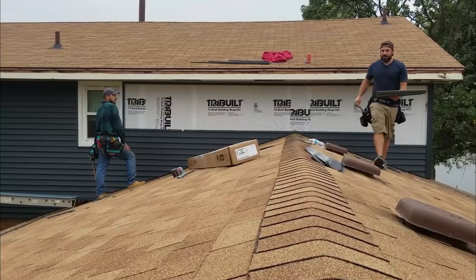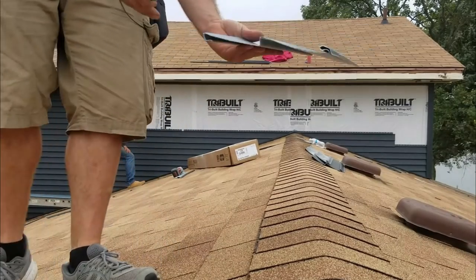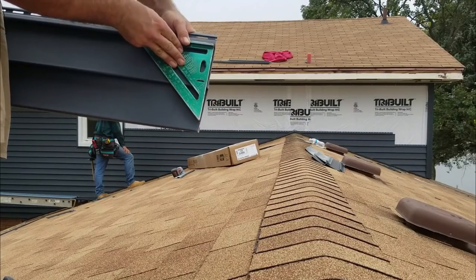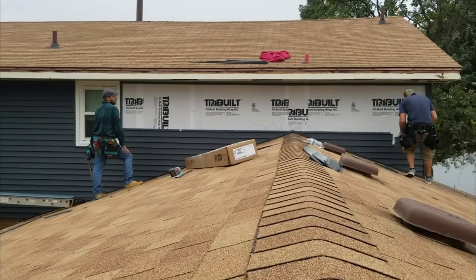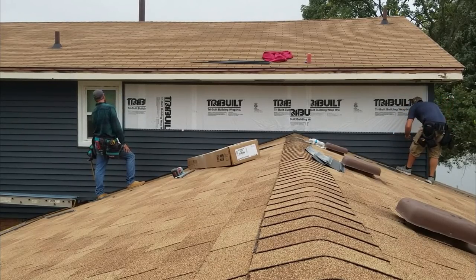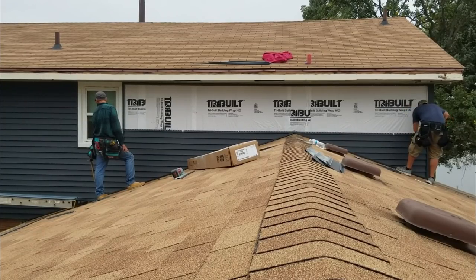For anybody who wants to say anything about me not using a square, let me just show you this real quick. It all gets hidden in the J, or the corner post. Corner post is like 7/8. That ain't terrible. You know what I mean? It's fine. Yeah, for something that's going into J or a corner, I recommend people start off using their square, at least until they're really comfortable cutting siding and using snips. I wouldn't expect a rookie to do that and stay correct. There's still some skill to it.